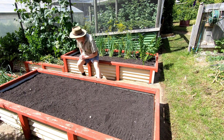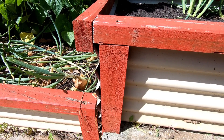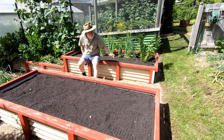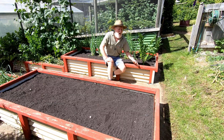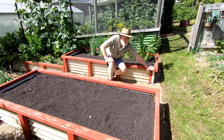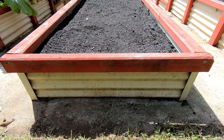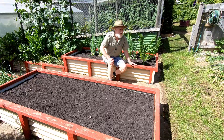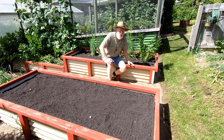On the corners I've just run the ends over the side piece — a bit like a ladder. On the other end I have put a little piece of flashing over it, which was simply there to protect my garden hose when I pulled it around the corner so it didn't cut on the edge of the colorbond. The end piece is simply a rail that holds the two side ladders together, and there are no uprights on the ends because at the 900mm spacing it's not really necessary.